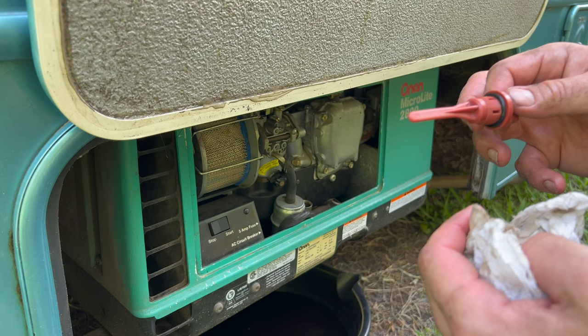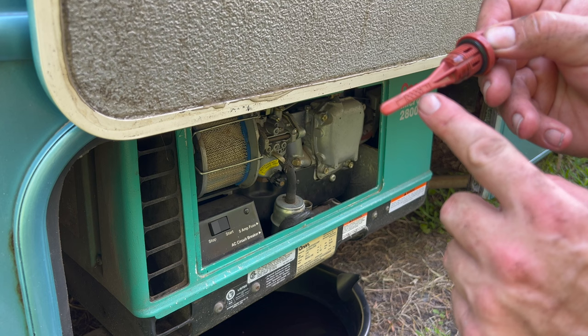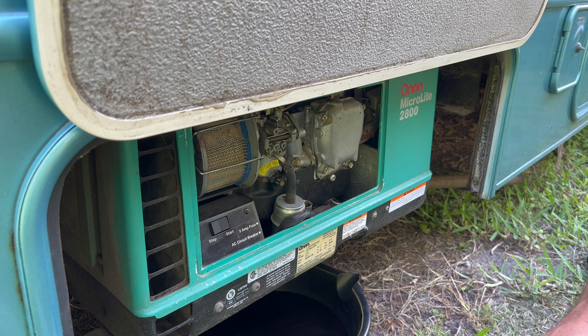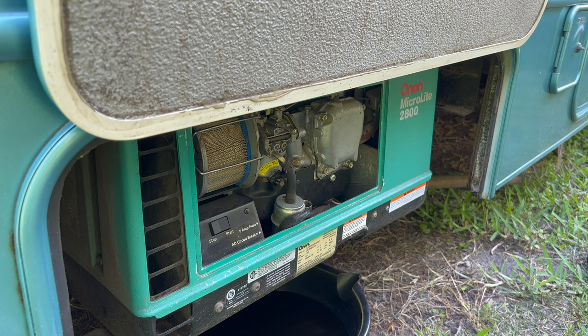This is the proper procedure on how to check oil in this generator — you don't screw it in. You just dip it in and pull it back out, and that'll tell you your level. I see people screwing it in and that's incorrect — don't do that, you won't get an accurate reading. We're just about done draining our oil. Dipstick's nice and clean. Have a plastic bag down there so we don't make a mess. Give it a couple more seconds and we'll put that drain plug back on.